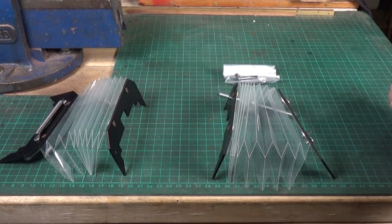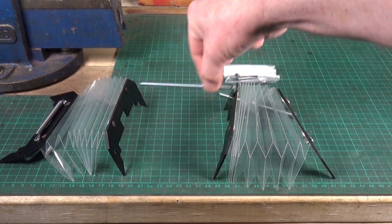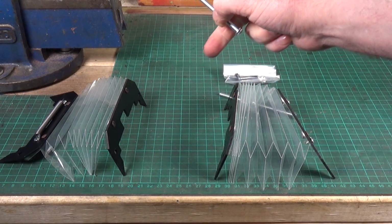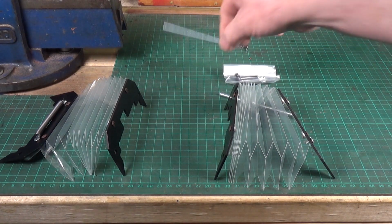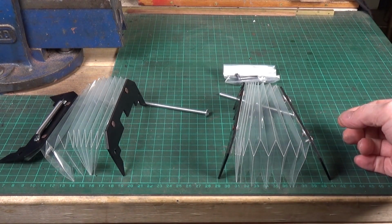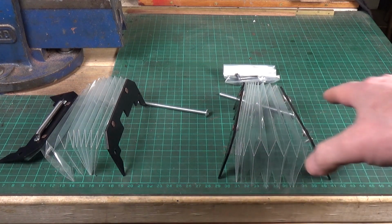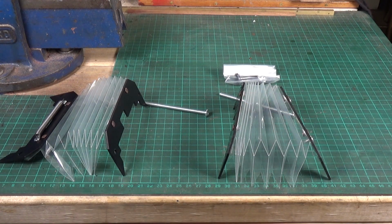And then these long bolts go through and hold these plates against the table support. And then this is fixed using, I believe, a spring at the front where the hand wheel is. So I've got to have a play with this and get it fitted on. Hopefully this will very nicely protect the Y-axis screw. That's really about it.